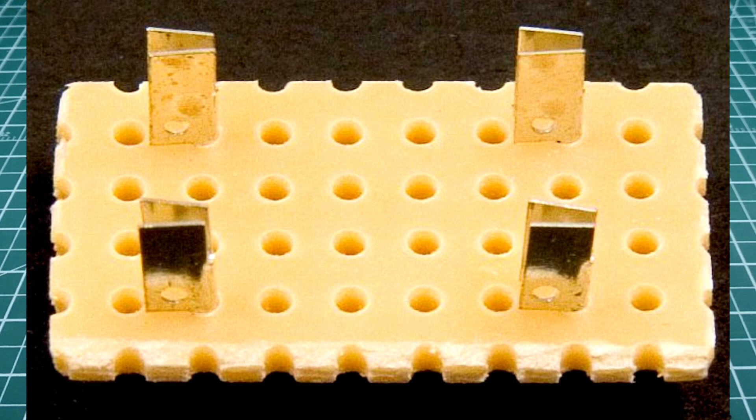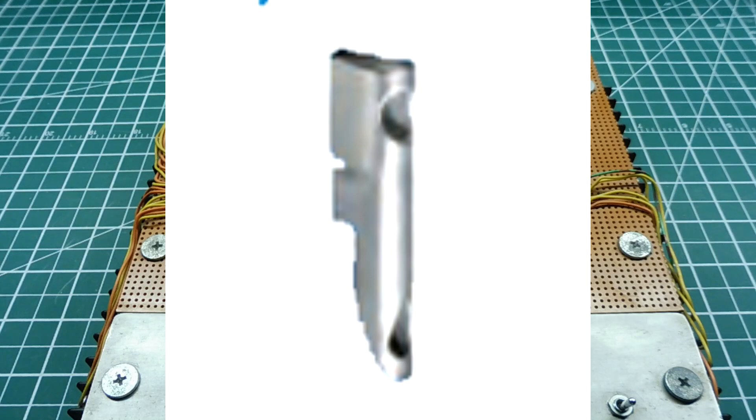Next came the phenolic boards with mounting holes. The mounting holes weren't .1 inch hole spacing because integrated circuits hadn't been invented yet. So they used flea clips — these little clips that they would press into the protoboard — and solder their components to these clips and do all their point-to-point wiring using this technique.